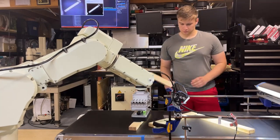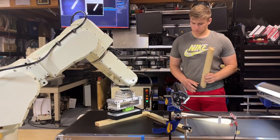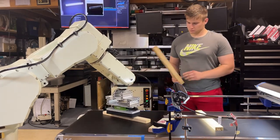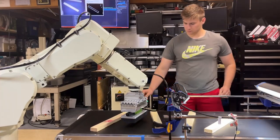Typically this is done through a 7th axis that's reading an encoder that's on the conveyor belt. Only my controller didn't come with one. While it has the option to, finding the parts to get this to work is going to be extremely expensive and probably impossible at this point. So I need to get it to work without an encoder.